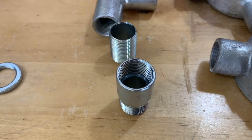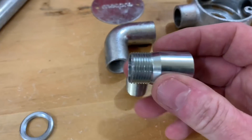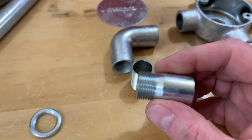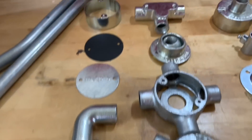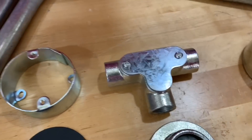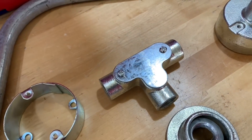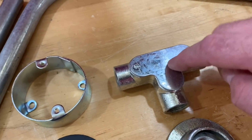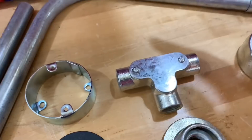In front of it we've got a three-quarter inch to 20mm adapter — one end being the old imperial measurement and the other 20mm — so we can couple together two different systems. We've also got an inspection tee; the plate on the front comes off so we can remove it when drawing in cables to make things a little bit easier — just for ease of drawing in.